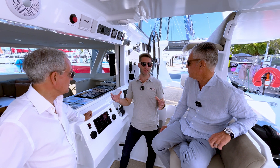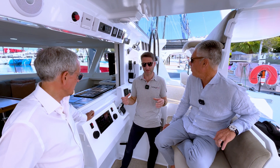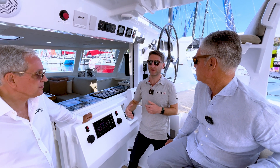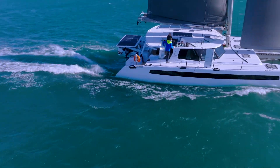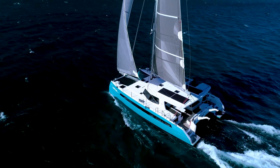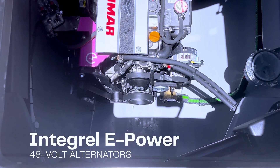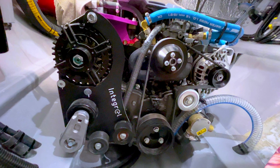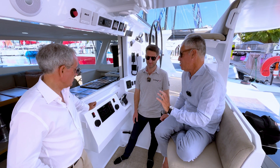With such a quick charging rate, you're not speccing your battery banks up for range so much — you don't have to carry kilos and kilos of batteries anymore. You've got a stripped-down battery bank, charge up quickly, and then move on to electric. That's very important for us building more performance-oriented catamarans, since we want to reduce weight wherever possible. When we adopted the integral alternators five to six years ago, we removed generators from our boats entirely — Balanced Catamarans now operates with just the two engines.